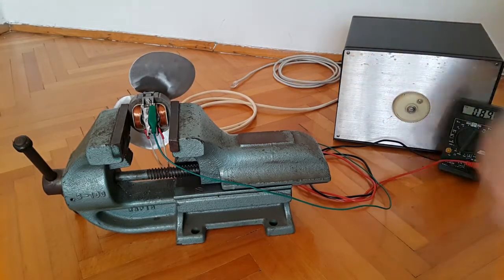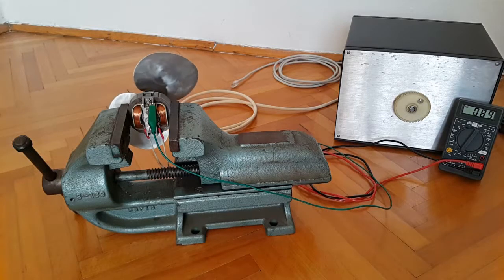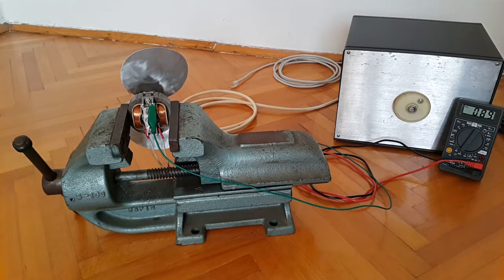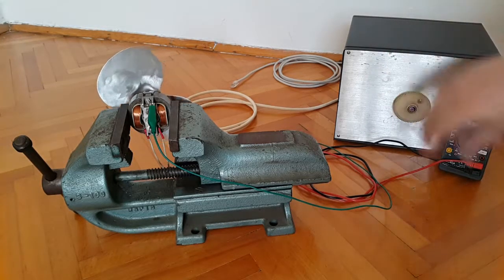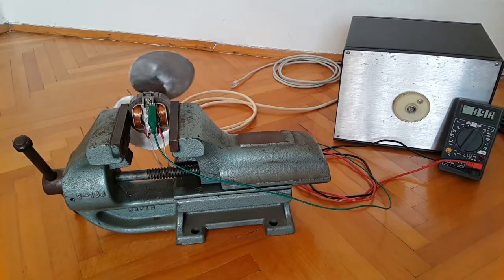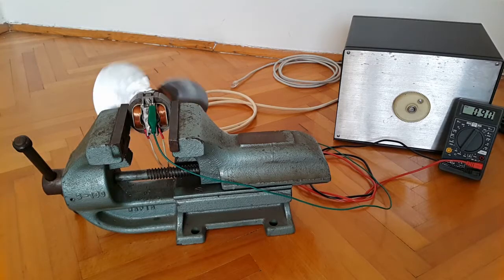Oh, look. The motor for a moment started to spin, then it stopped. So 90 volts AC and it starts to spin without any assistance, naturally. So this is nice movement of the shaft of the rotor, because previously the motor started to spin at 95 volts AC and the mass on the shaft was basically nothing, so this is much heavier, but it starts to spin.